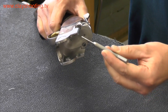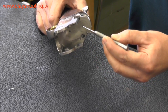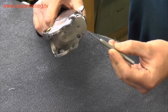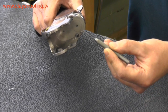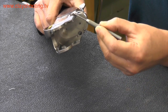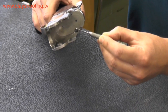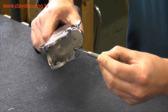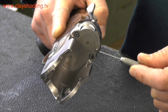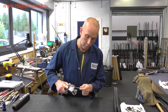On the face of the action there are some visible holes — bottom and top — which allow the firing pins to come through the face of the action and strike the cartridge. There is a small pin located here which works in conjunction with the top lever mechanism. There are two further visible pins which are actually one complete item — these are what we call the locking bolt, and they lock the barrel down into the action when the gun is closed. This is the top lever trip pin. It is worth noting that this pin protrudes from the face of the action at an angle and should not be straight.